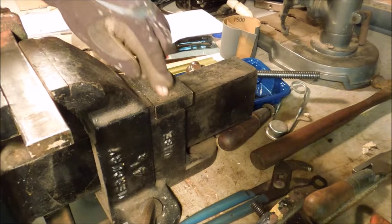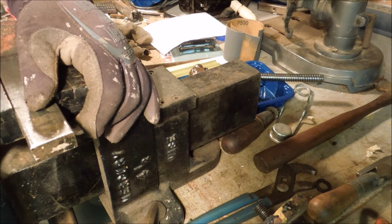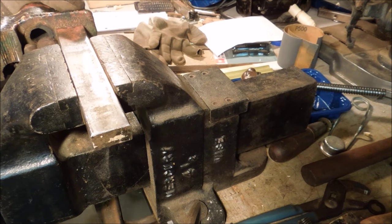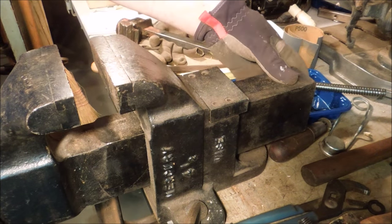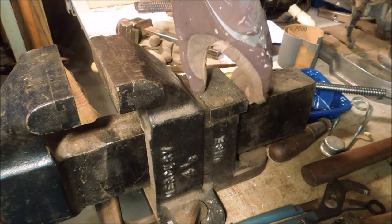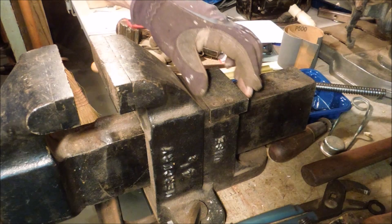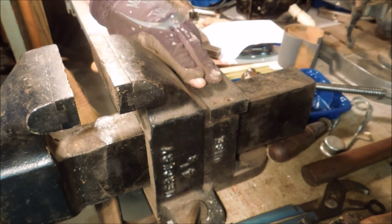See this metal plate back here? This is a cast iron vise. It's heavy — it weighs about 60 pounds — but somebody drove onto this jaw and that caused this beam to rock up inside the casting and pop off the top of this cast iron. So I cut it off, filed it flat, and bolted on this piece of steel plate.